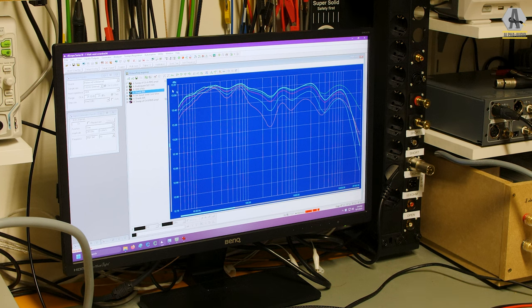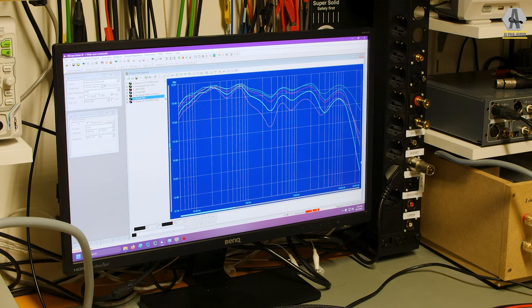But the largest difference is actually the balance in this response measurement, because the top here is quite the same. They're not that huge, but here we're talking about 5 or 6 tenths of a dB, and we're measuring it at around 25 kilohertz right here. No, you don't hear it, but the harmonics you do. And if I pick this blue one, the Dryade 404, or the AudioQuest Slip 14-4, we have a 2.8, that's half a dB roll off.